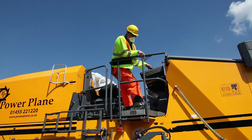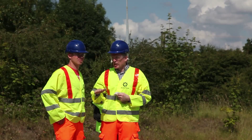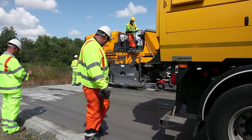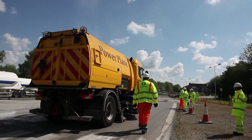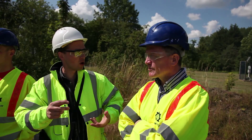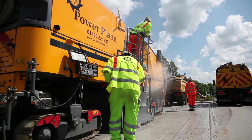Fine milling is an answer. Fine milling with diamonds we think will improve that, so that's why we're here. This concrete has been tested at 70 Newtons — it's not soft concrete — and some of it's got hard grit stone and some of it's limestone. We're here to re-level it, re-profile it, and put a finished texture in it.